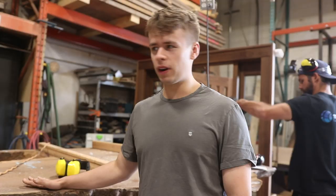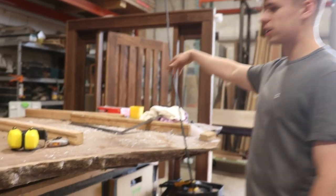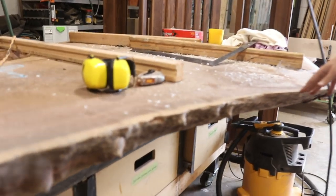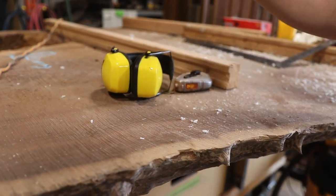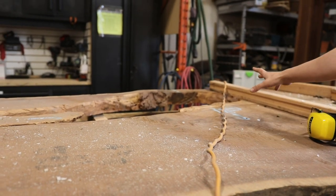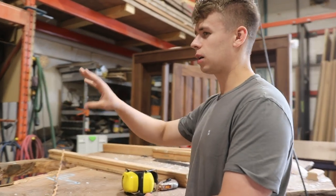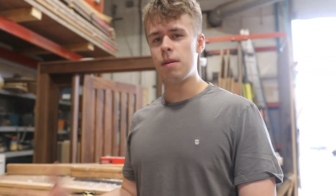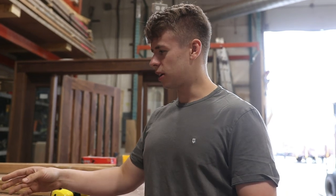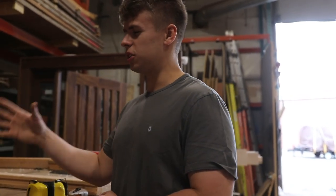Here is one of the tables for Ellis Don — this is the 16-foot one and we've got it marked out where we're going to cut. This one is going to have a pretty big resin fill, probably a solid black fill. This is all natural decay that's happened. We've already gone in with a wire wheel and cleaned all of this out, which is a really important step — if you're going to fill something with epoxy and you don't use a wire wheel to remove all the debris, it's not going to be a strong bond.